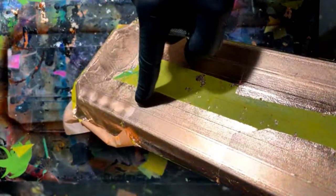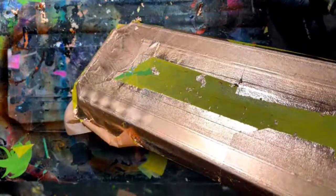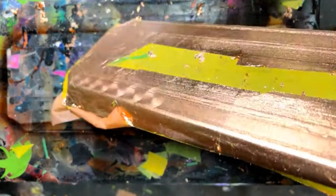What I'm doing is I'm overlapping about 40%, kind of leaving the center. So I'll stick it right there, give it about a half a turn. And as you can see, it just sands in a swirl, an engine turn is what they call it.